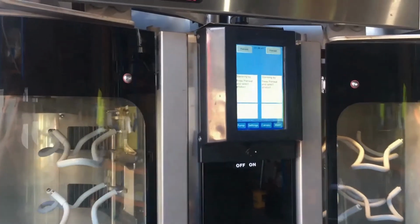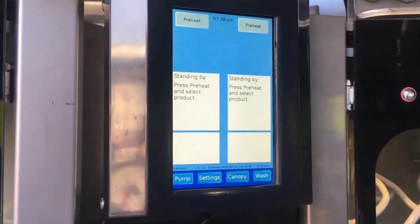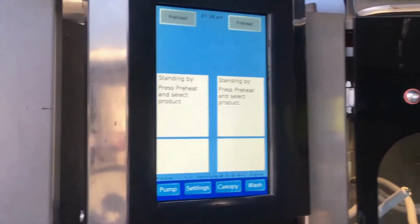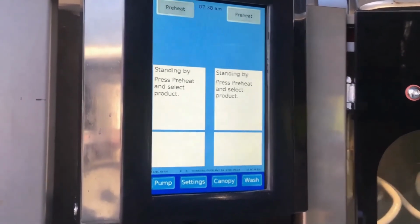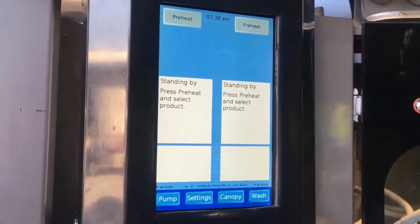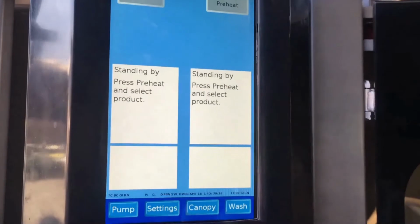When attending site to service a Roastrunner oven, it is advised to let the oven cool down first. While this is happening, you may check with the deli manager to see if there are any existing problems with the oven that need correcting. Make sure you ask whether they are harvesting fat every night. Once you've done this, it is good to check the logs.